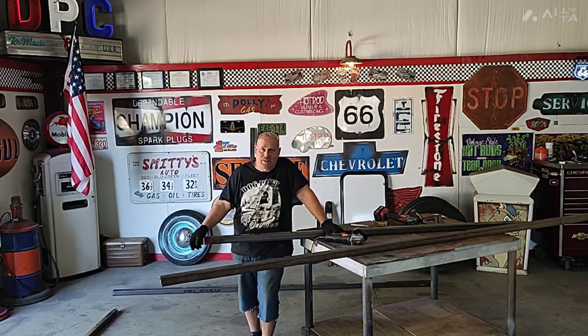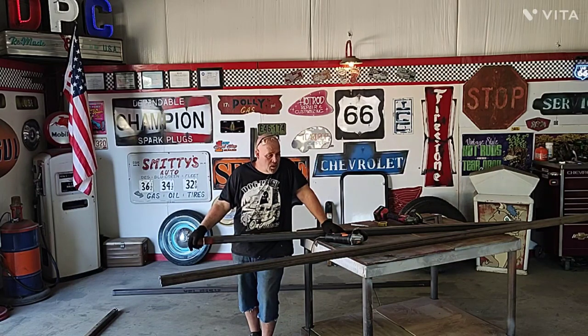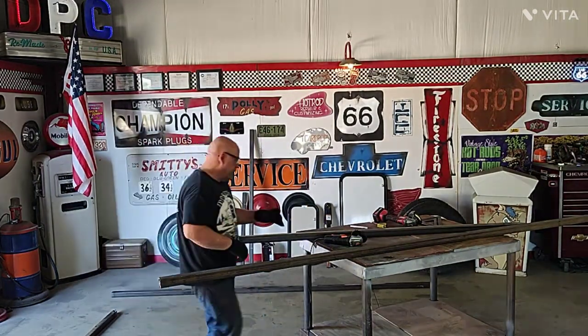It's a basic trailer 101, really. 45s on the angles, gussets here and there. Crossbar and tongue, and it's not rocket science. So if you're wondering why I'm not using the plasma or something quicker, it's more or less for you guys' benefit. Let's cut a few more 45s, eh?